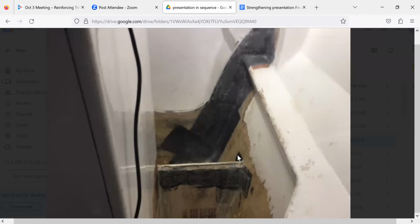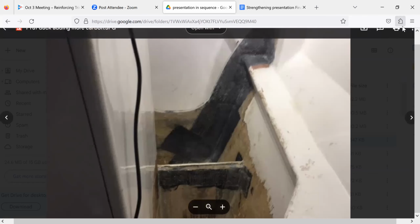And back to the thing about carbon versus glass, someone pointed this out to me earlier, sometimes you really don't want to use carbon and glass combos because carbon acts different than glass does. Maybe I did this wrong. You guys can tell me if you think I did, but in the back of my head, what I'm doing here is making a beam to resist some bending forces. Since I'm not tying this into the boat as a whole, just essentially making a beam, I figured it was okay. Is that the chat?